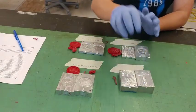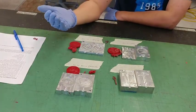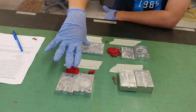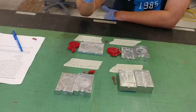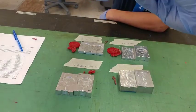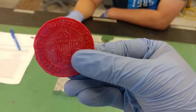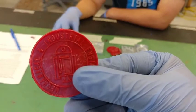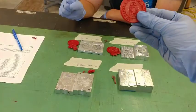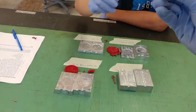We have opened all our molds and laid them out here — each made under different conditions — so we'll start to compare the outcome of each one. The quality is fairly good, but if you look at the top of the coin, it's actually losing some details in the lettering. You can also see a little bit of a machining mark on the surface. The same thing occurs on the other one — you start to lose details on the top.